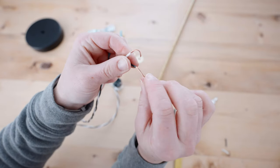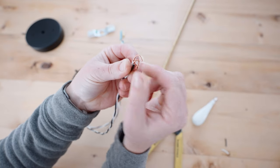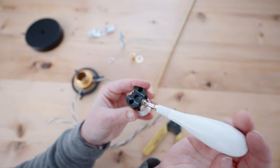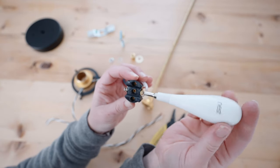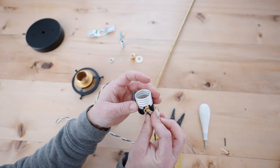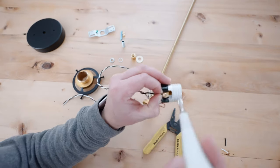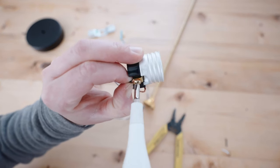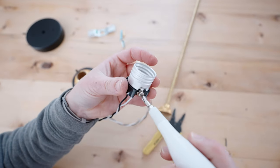As a tip, you're going to want to hook these wires around the screws — it makes it so much easier. Unscrew the screws on the socket, hook the wires onto the screws in the direction that you will be tightening them. Note: it doesn't matter which wire goes on which screw here, unlike with outlets.